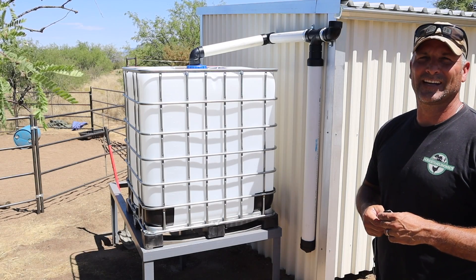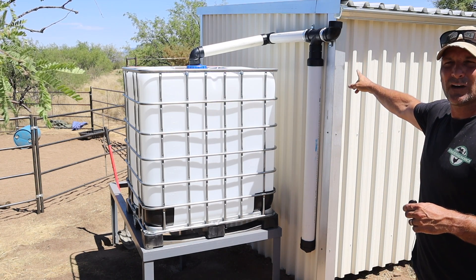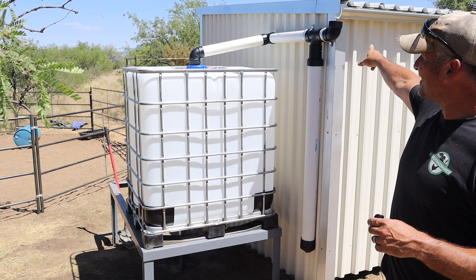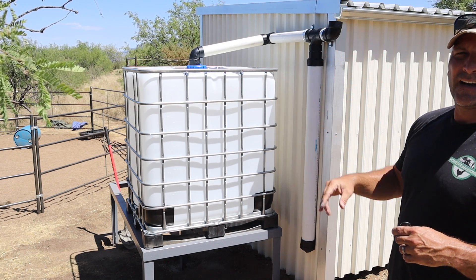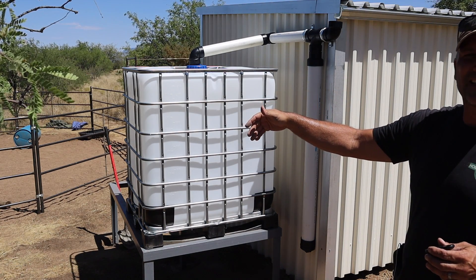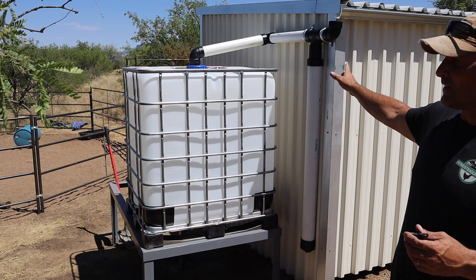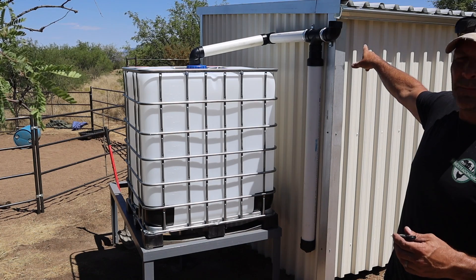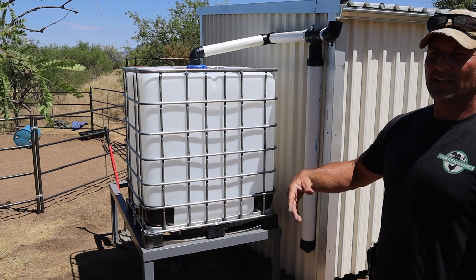Right now I've got all the pieces fit together and lined up just how I want them. I glued the middle section where it's holding the first flush pipe because that's going to be holding quite a bit of weight. But the inlet side where the gutter is and the little outlet arm that goes into the IBC — that is just dry fit so that I can move and remove an IBC tote as I need. Right now I'm going to disassemble this, paint it to protect it from the sun, and reinstall it. I'm also going to add a little screened inlet on the elbow coming from the gutter, then add the other IBC tote, connect the piping down below, and give you a little demo.